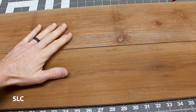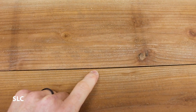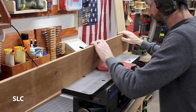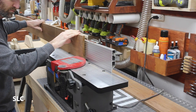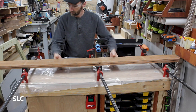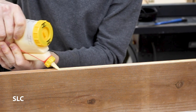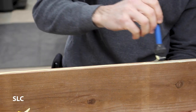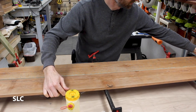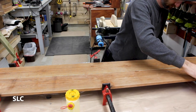To get the full width of the wood I need for this project, I need to glue two of these together right at an edge. But as you can see right along here, there's just a little bit too much of a gap, so we're going to have to put these over my jointer and make them nice and flat. Now that is a much tighter seam.